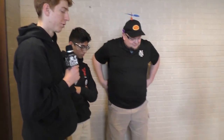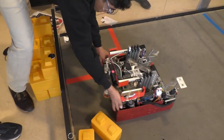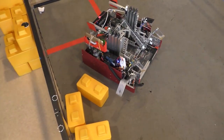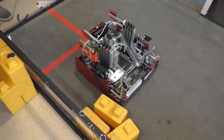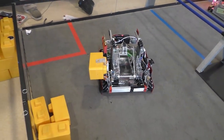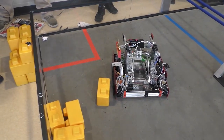One of the cool things about our robot is the autonomous claw we built. During our first competition we found that using the active intake during autonomous disturbed other blocks, so we created a claw-like mechanism controlled by a four-state time function. Once a driver lines up the robot with a block, the arm swings in and covers a wide range — within two inches it can always grab, because the bottom servo swings as a function approximation of the top servo's position. This allows it to stay closer to the robot for longer, and we have four states to make it easier for drivers to control.